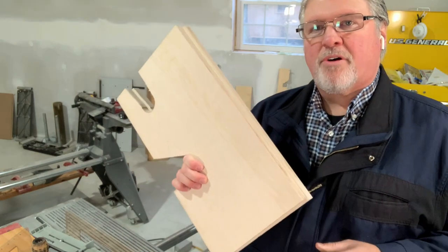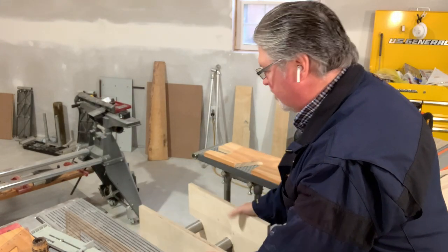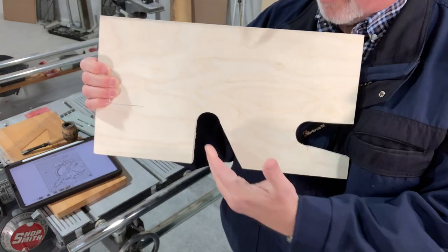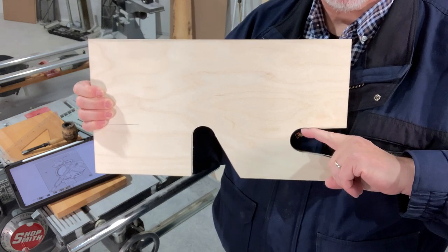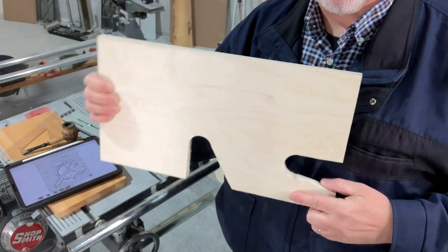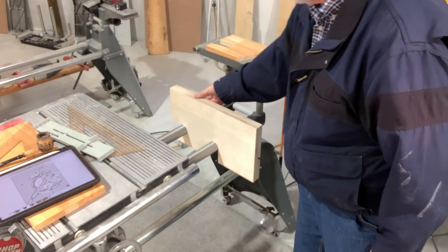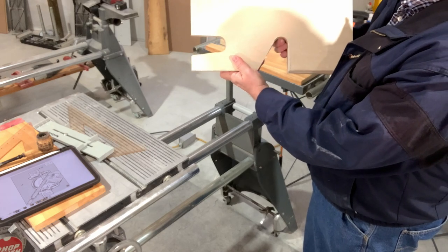After playing around with that, I've already cut a couple of pieces of Baltic birch that I'm going to use for this application, and they do fit in place. After boring the holes to fit over the tubes, I made straight cuts and found that was a little bit too tight, so I gave myself a relief cut here and a relief cut across the bottom, but made sure I did not increase the size of this portion here — I wouldn't want this to cause teetering. I brought my two pieces together, laid them up here, and aligned them to make sure everything is perfectly flush.